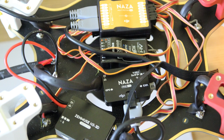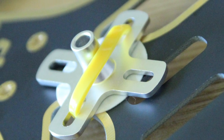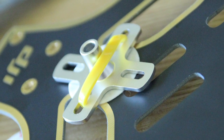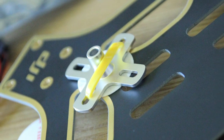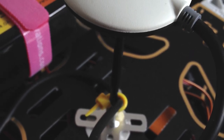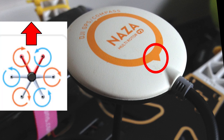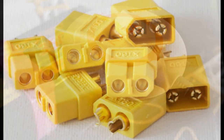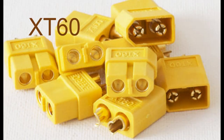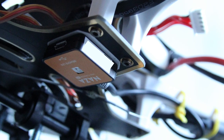Once you've laid everything out inside, we're going to install the GPS antenna for the NAZA. Ideally this should be located as close to the center of gravity as possible. I found the round sticky pads are very strong and should be perfectly adequate, but I also used a cable tie just in case to make sure it stays still. I then used Gorilla Glue to attach the pole and the satellite — I can remove it should I need to. Do note that the arrow on the satellite must point to the nose of the aircraft, which is the direction the aircraft will fly in. For the LiPo battery connection I prefer to use XT60 connectors as they are quite strong — most new LiPo batteries will come with this connection and they're only a couple of pounds for half a dozen.